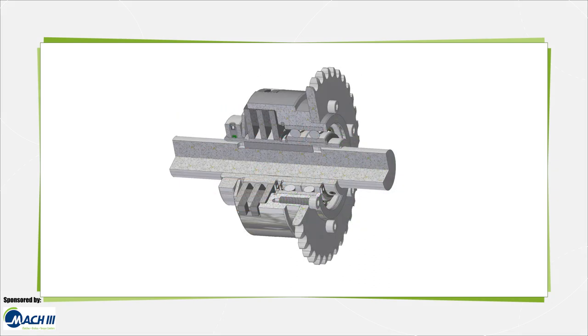Consider Mach 3 friction torque limiters. These transmit fixed torque from one machine section to another except during overloading. The value of that torque limit is set either by the manufacturer or by the end user in the field via an adjustment nut held with set screws. Upon torque in excess of that value, the torque limiter slips but doesn't disengage — which is why they're called slip clutches. Most friction torque limiters require sensors and a means of stopping that overload condition to prevent the torque limiter from continuing to slip and sustaining damage.